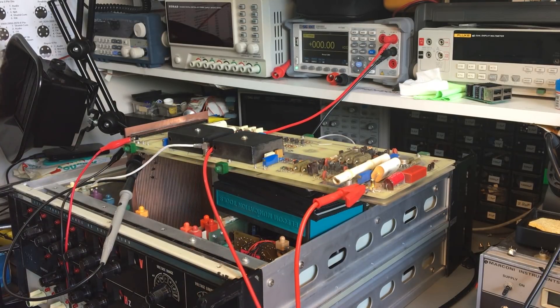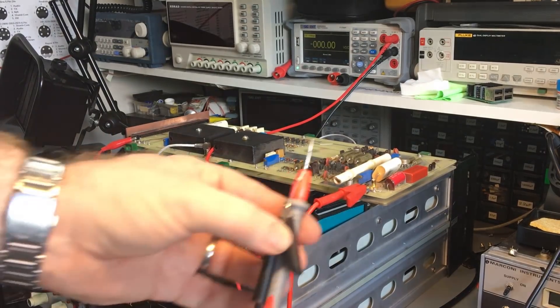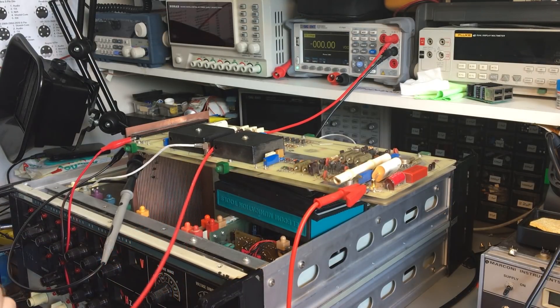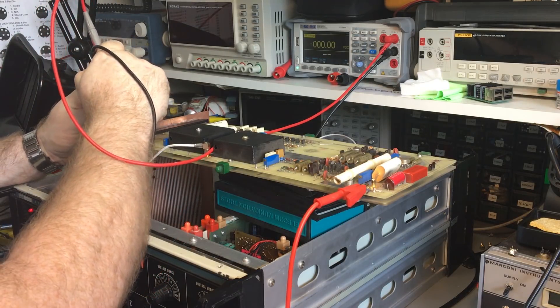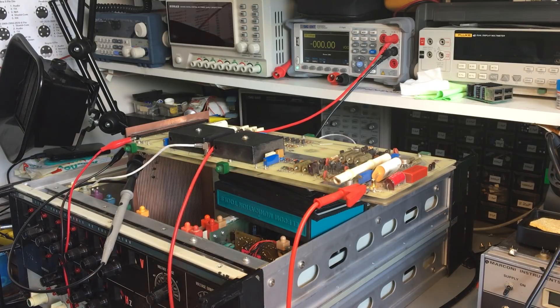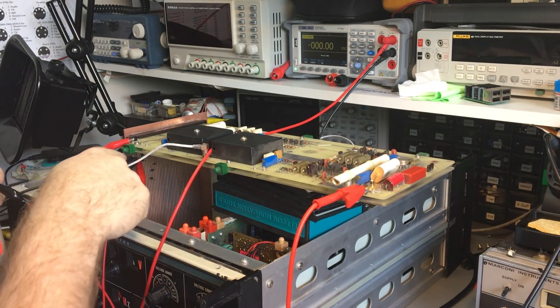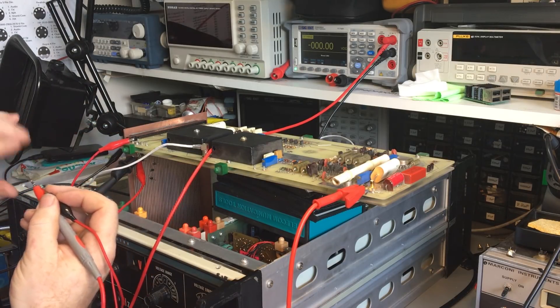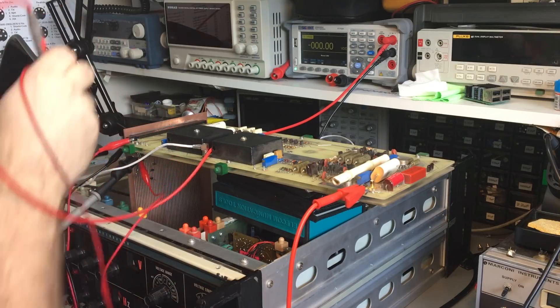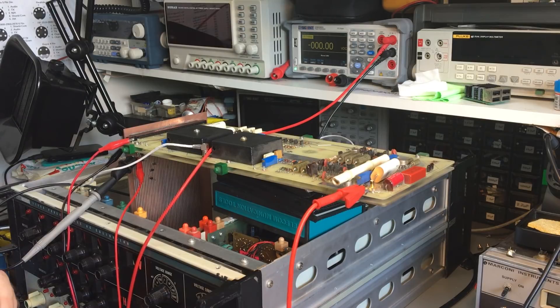This check requires adding a 100 ohm resistor load — the voltage must not drop by more than 0.5 volts, so it mustn't go below 4.5 volts. With the 100 ohm resistor on the probe: 4.96 volts — still absolutely fine. I also reconfigured to use pin 86 as the common reference to be sure, and the result was identical. What I was doing before was fine anyway.